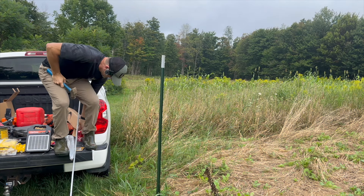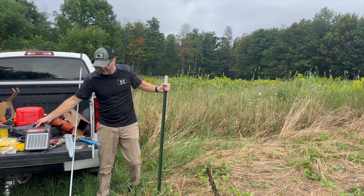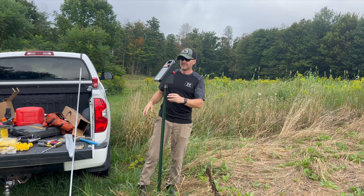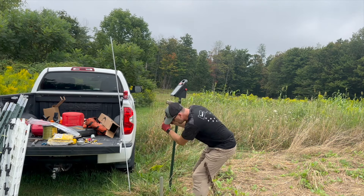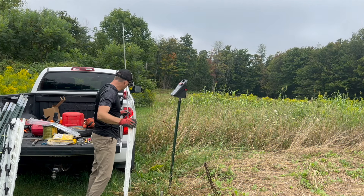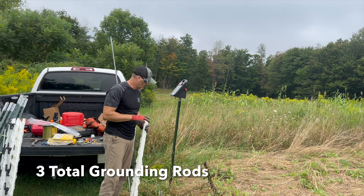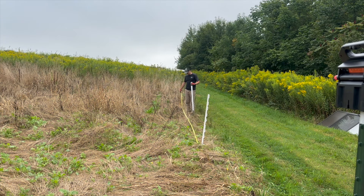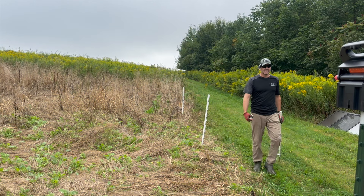Don't knock over the Coke Zero. I'm just not going to drive them to a huge depth — it's only going to be there for five weeks at the maximum. I got one grounding rod in. I don't have a hacksaw or a chop saw, so I'm going to make this into two four-foot sections rather than one eight-foot. I did bring a weed eater, so I'll be able to weed eat and keep the brush off, because you don't want the electric grounding out on weeds.